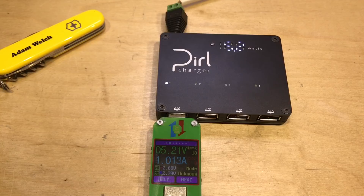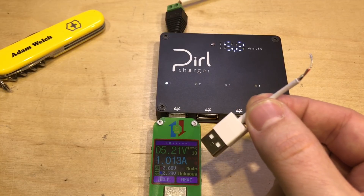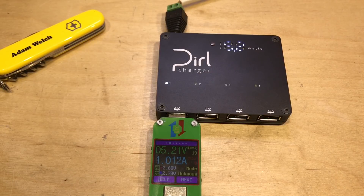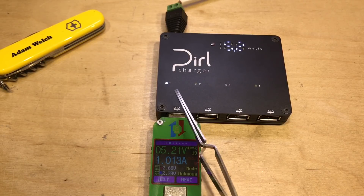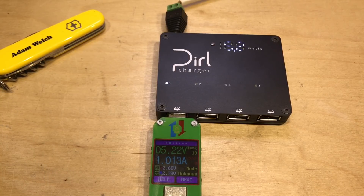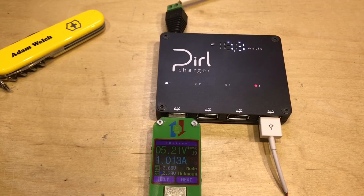For this test I hope to prove two separate points. Channel 1 is active, pulling 5 watts — 5.2 volts at 1 amp. I have a USB cable with the positive and negative shorted together as a fault condition. Plugging this into channel 4: straight away channel 4 goes into error mode with a red LED, while channel 1 remains working absolutely fine. Two ticks — the channels are completely isolated, and the fault detection works without putting the shed at risk.